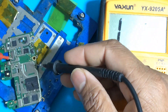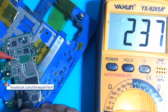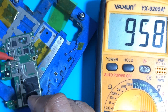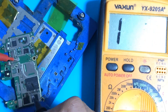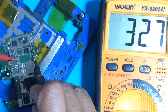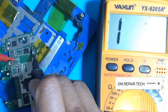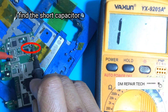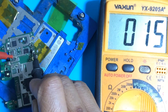Now try here. If we find any capacitor near this area, we will try to remove them one by one. Here — full short, look — meters are showing red light. So the reading is full short. I found the area with a red mark: three capacitors are showing full shorted.